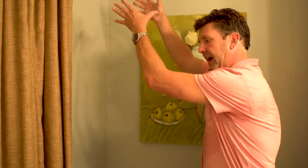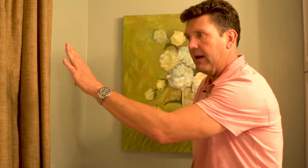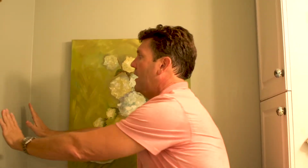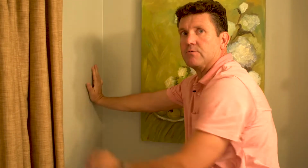We located that framing bypass in the attic, and now we've located where it is inside of the house. It's a shaft that goes all the way from the attic down throughout the house. How that's a problem is we have warm, moist air generated in the shower. If we're not able to get it exhausted through the bathroom fan correctly, the warm air hits a cold surface, or vice versa, and you get all kinds of rot, mold, mildew, and other issues inside of this wall.